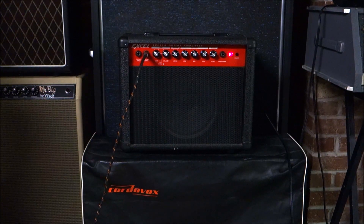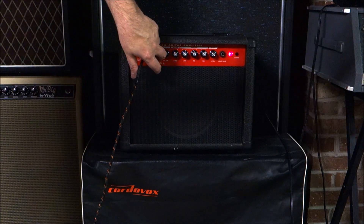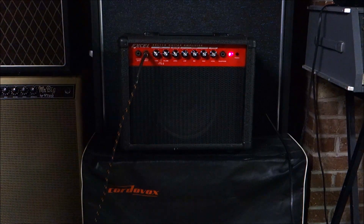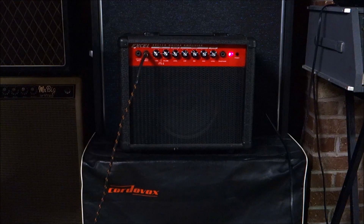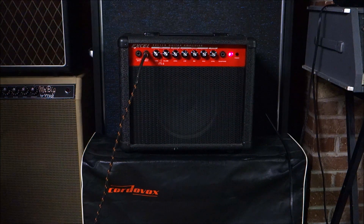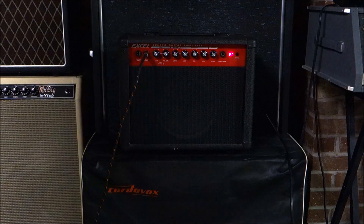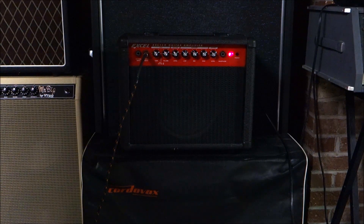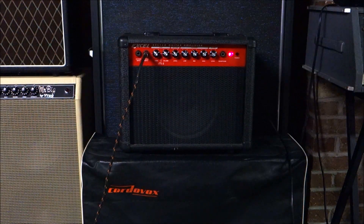So the problem this amp had was a bad filter capacitor that was causing it to make a horrible awful popping noise when you turn it on, and it would cause crackle and things after it ran for a while. Let it sit and cook for a couple of hours, but that's probably all we really need to do to it. If it's teaching the next generation of students how to play guitar so they don't make horrible awful synthesizer-sized pop music — good for them. Thanks for watching and look for you on the next project.